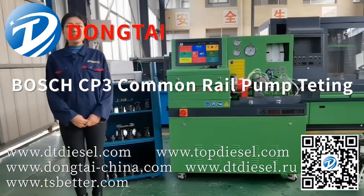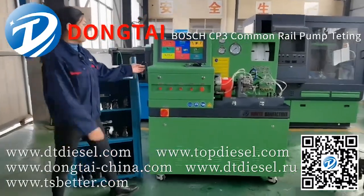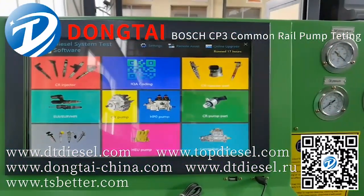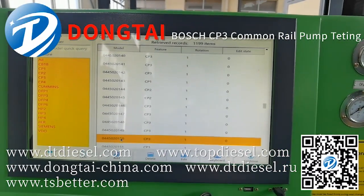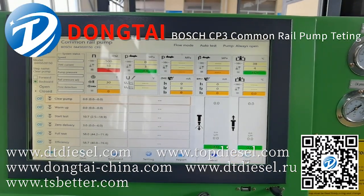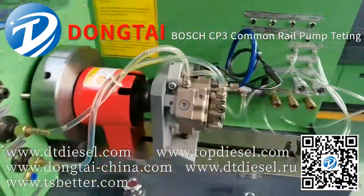Now we'll show you how to test Bosch CP3 common rail pump. First, choose the CR pump function on the system. Choose the correct pump number. You can check all the test data on the screen. Now let's see the connection for the pump.